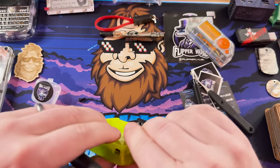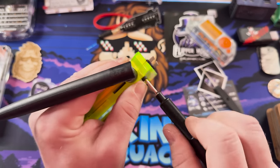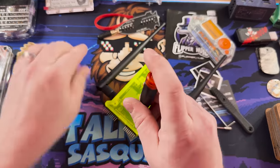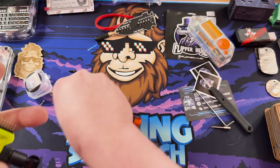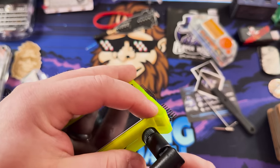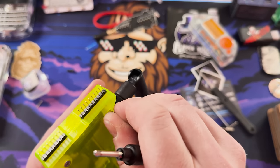The top screw is the one that had me a little worried. One thing about PETG is that it gets soft when warm, so the faster you work, actually the easier it is. This is going surprisingly well. I didn't have high expectations for this screw going in without breaking it, especially with PETG. Turns out there was a heat-set insert in the top part of the case that we weren't catching — that's what happened with the original screws pushing through. An easy enough thing to do; I've done that a few times myself.